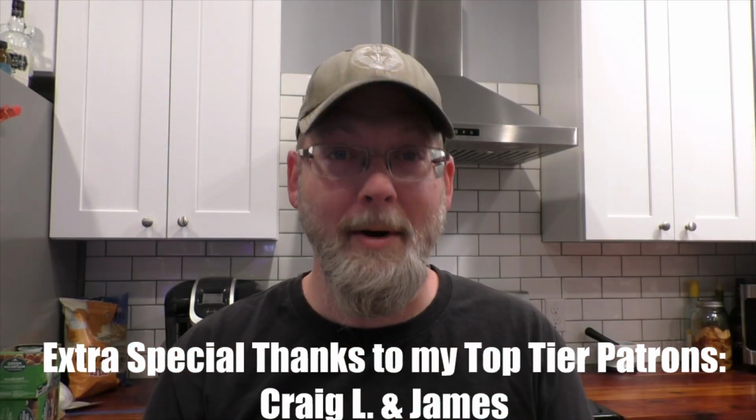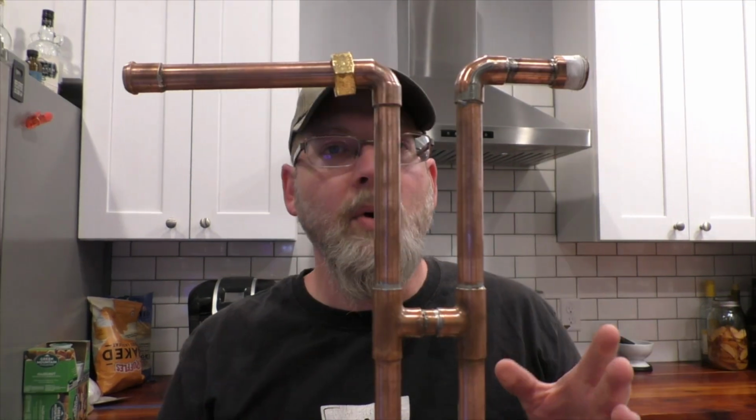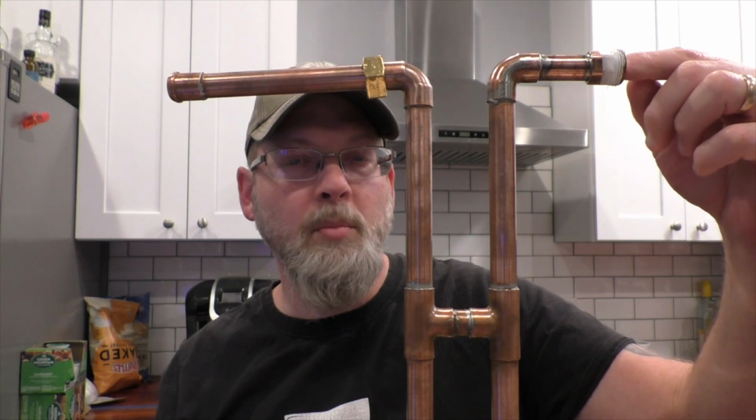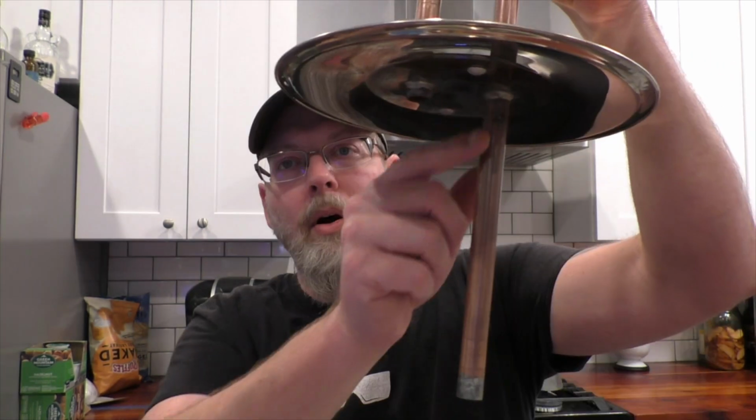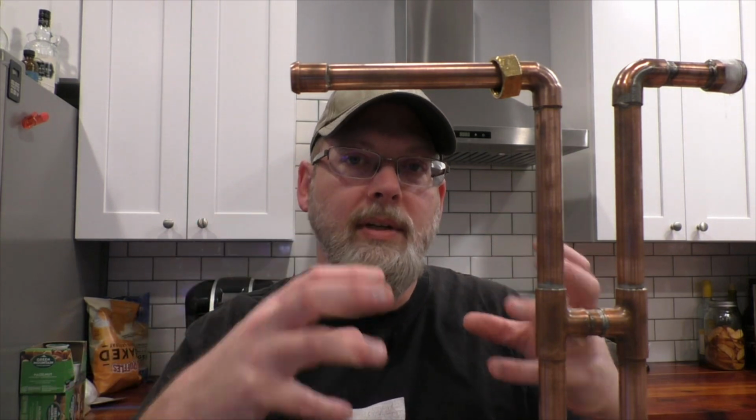Okay, moving on. So if you don't already know, a thumper is basically a secondary reaction vessel for your still. They work by piping the vapor in from your boiler into this tube all the way down to the bottom, so when the vapor comes through, it's going to be forced through some liquid that you have down in the bottom of your pot. When it hits that liquid, it bubbles and it thumps, hence the name, and that vapor cools down slightly and condenses inside the thumper until the heat that's being pumped in from the boiler brings the temperature of the entire system up.